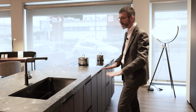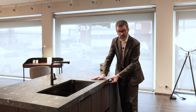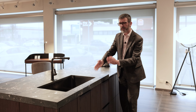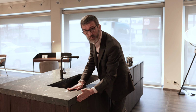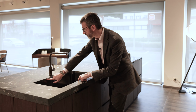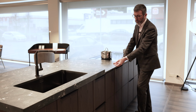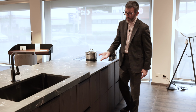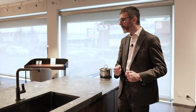And so we said, okay, we'll have the sink unit with an increased thickness. Of course, it is hollow inside. It is built with 2 centimeters panels, which create this sort of cage, okay? And you can perceive the 2 centimeters right here, okay? And then we move on with a standard 2 centimeters top on the side. So, well, you still have the joint, you still have this line between the two parts, but you don't perceive it. You perceive it as a positive aspect because we differentiate the heights.